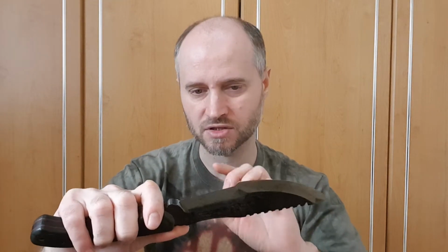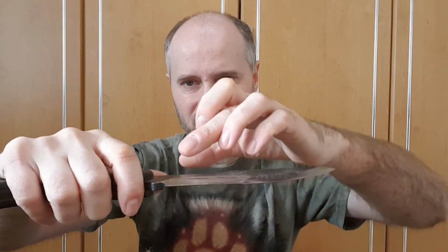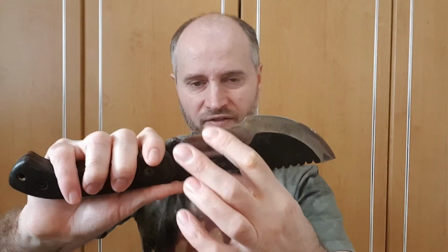So how I did it easily. I always removed the corners. The story of how it worked, I think I told you a couple of times in videos, so I will not start with that. There was a really high secondary bevel. Firstly I removed it on the draw knife area, and that was when I changed it that the performance of the knife really increased. Really, you can see how it increased.